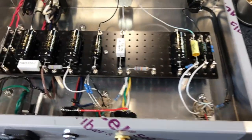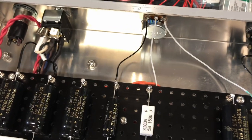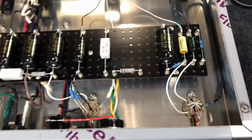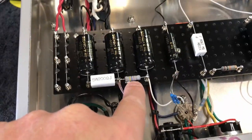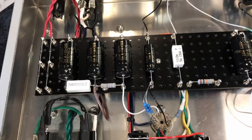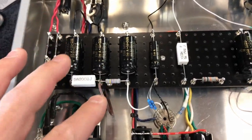Just another quick update on what's going on. I've connected a lot of the wires here - you'll notice they're not exactly the correct length, they're a little longer than needed. This is just tacked in here for testing. I have tested it - it does work. You'll see my crude artificial center tap there - we'll talk about that in a second. This amp does work, it sounds great, it worked right off the bat. I'm now in the stage where I'm going to be adjusting these two resistors to get the amount of voltage I want in the spots that I want. Right now I have an ideal amount of drop between the plate and the screen. This 4.7K is actually about spot on in terms of the voltage drop I need.